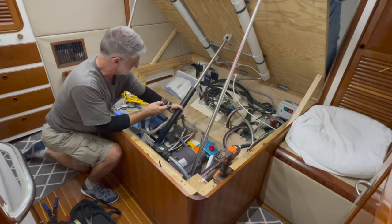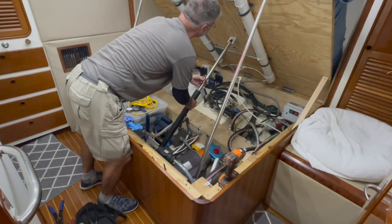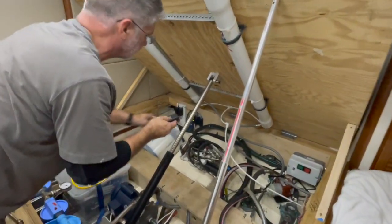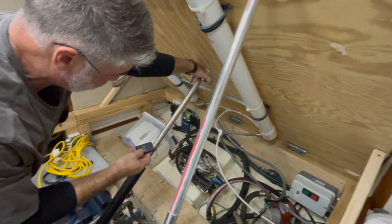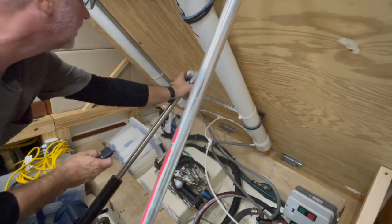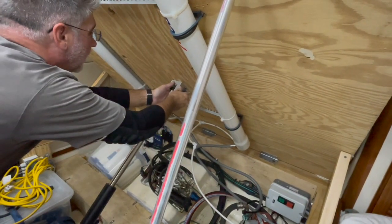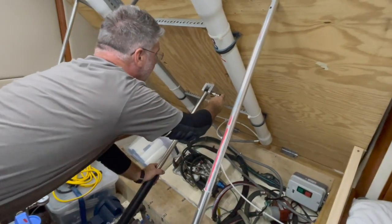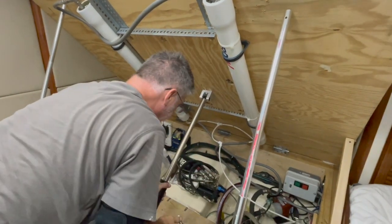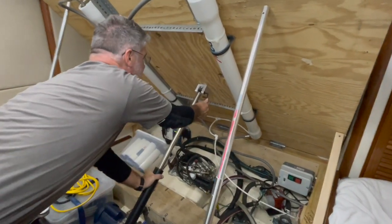I was hoping that wasn't the end of the travel. Now I'm going to grab the other pin and figure out the right distance. It's just a teeny bit short, so I'm going to put pressure on it and tap it up just a little bit. It's moving up the bed — there we go. Now I'll use my ratchet. The reason I'm pulling that out is it's just a teeny bit undersized, so I'll use the actual Allen wrench to tighten it down.